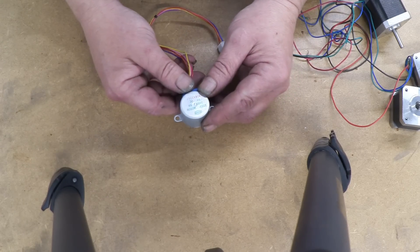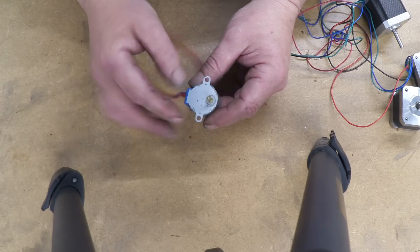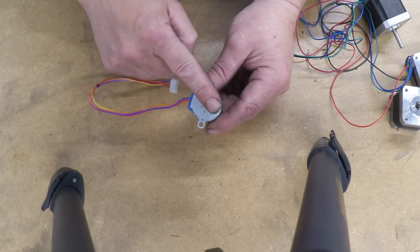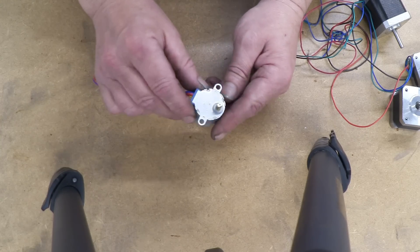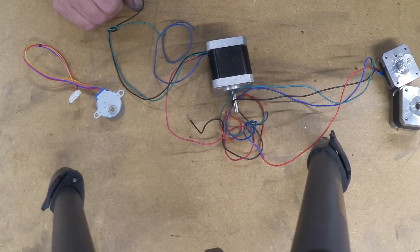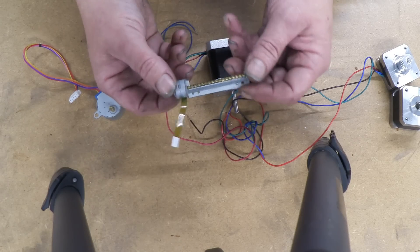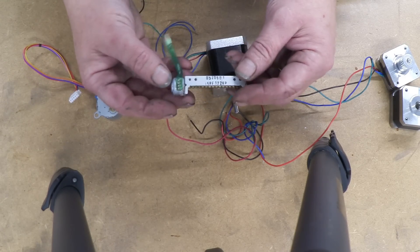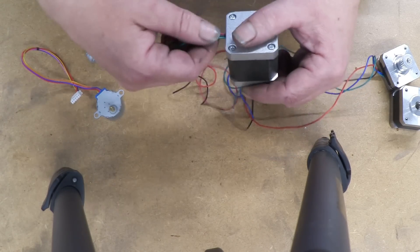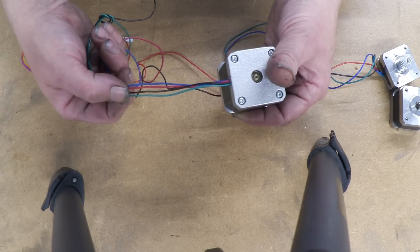There are a whole range of stepper motor types. Here's a very popular one — the 28BYJ. It's a geared stepper motor with gears inside that make it quite hard to turn, but if you put a crank handle on it, it'll output a surprising amount of voltage. There's also a stepper motor I took from a CD-ROM drive. Most stepper motors come with four wires, and those four wires go to two separate coils.